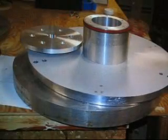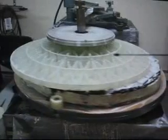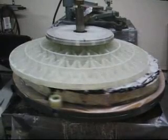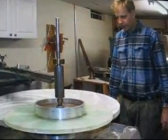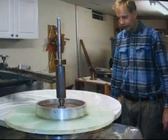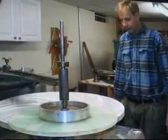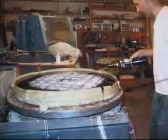Here's Mike Maddy and myself making the tool — getting that plastic surface and then putting the glass on the tool. I had to make some parts so we could machine it. Here's the mirror being lifted into place. This is Pyrex — the others are either BK-7 or several other glasses, but this is cast Pyrex. This is the mold that was used for that glass. He machines it out — it's a computer-designed mold removed with high-velocity water. It takes about a day to make the mold. Here are the initial polishing pads, checking the wedge, and here we are with the full lap.